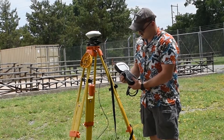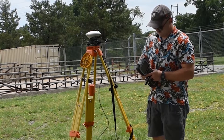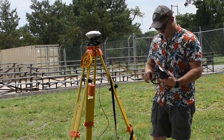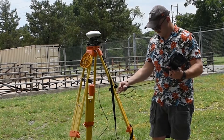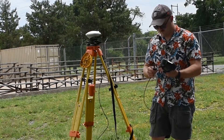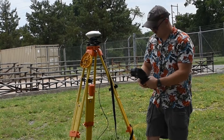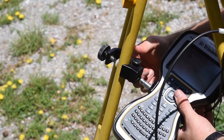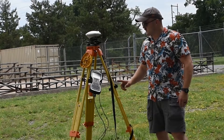For this mount, you want to go on like so with the metal nipple facing to the left as you're looking at the screen. I'll make sure I have a battery in, make sure it turns on, and then connect my TSC3-to-M7 cable. That's in place. Now the last part is going to be actually mounting the M7, connecting the radio, and then getting into the software.